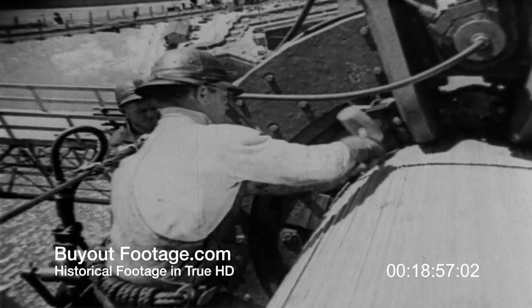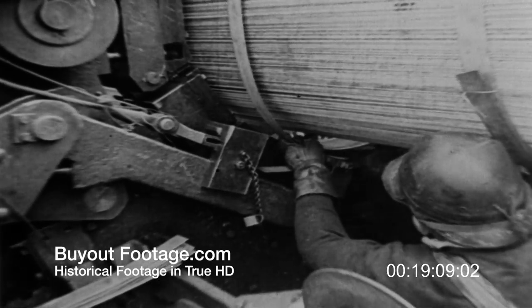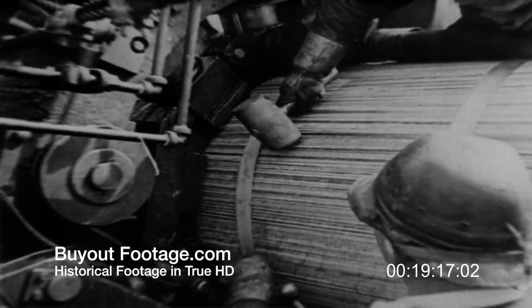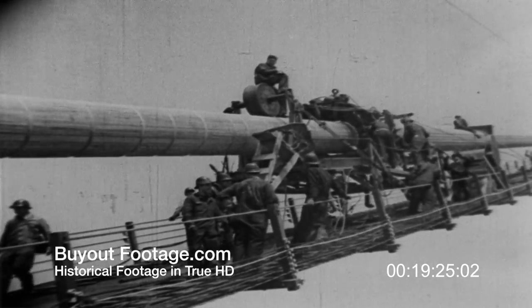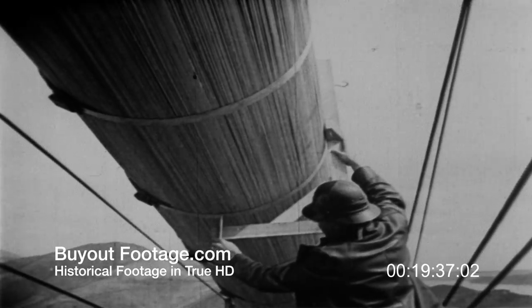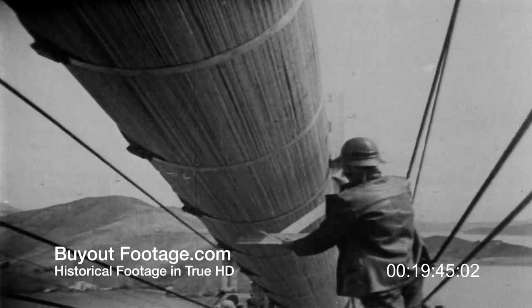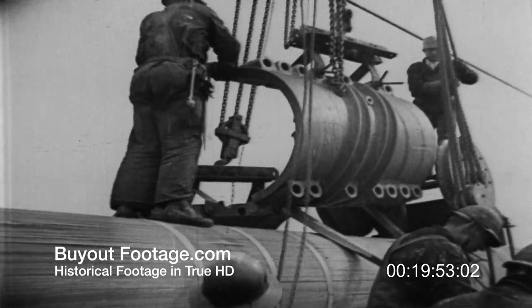If Bill would move over, we could see the compactor. The compacting machine consists of a heavy steel ring containing 12 radial hydraulic jacks, which squeeze the cable with a total force of 720 tons. One of the many Roebling flat wires is easily clamped around the cable to hold the cable wire in a circular shape after the compactor has moved on. Using a high-grade flat wire prevents the cable from springing back to its original shape after the tremendous pressure of the compacting jacks is released. With a template and scale, an engineer checks the final diameter of the cable. With the cable compacted, the next job is to place the cable bands on the cable — these are the castings which carry the hangers or suspenders. At the bottom end of these suspenders, the roadway of the bridge will hang.